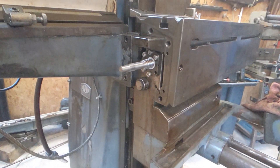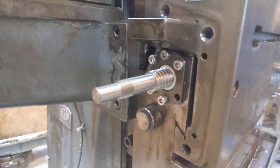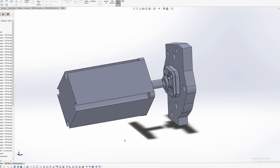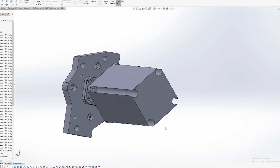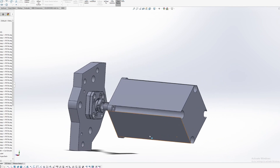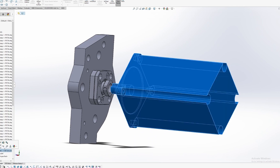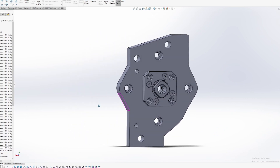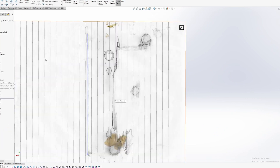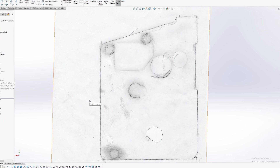I found that a 20mm ball screw had the same external nut surface size as the bore castings. The X-axis ball screw nut was really easy to attach — I made a 3D printed replica of the nut, then used it to drill and tap the castings. The end plates for the stepper motor were quite a lot harder. Initially I made them out of 3D printed PLA, hoping they'd last long enough for me to then mill out an aluminium equivalent. This was a really hard part to design as there's obviously no CAD for a 50-year-old mill, so I got the dimensions using a piece of paper and an oily finger, then put this into a scanner and made 3D CAD models from the part and the overall X-axis assembly.